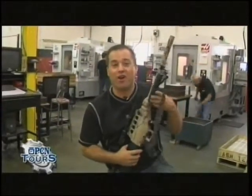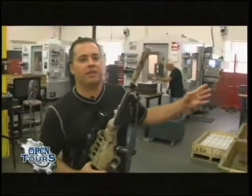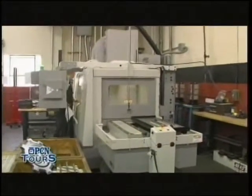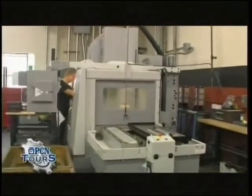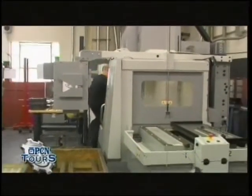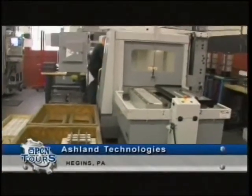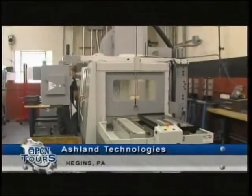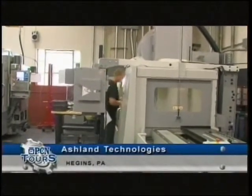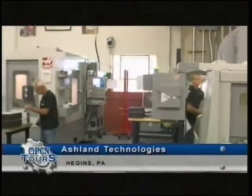Welcome to our horizontal room. What you're going to see in this area is basically our very high production machines. This one you're looking at right now is a dual pallet machine, which allows us to load parts on the external pallet while we're making parts on the internal pallet, saving setup time. This job used to take us maybe six or seven minutes to change over — now it takes 30 seconds. All the shuttle has to do is come out and go to the other one.